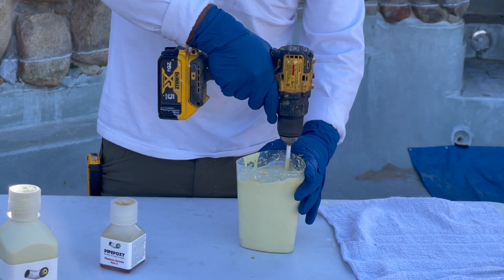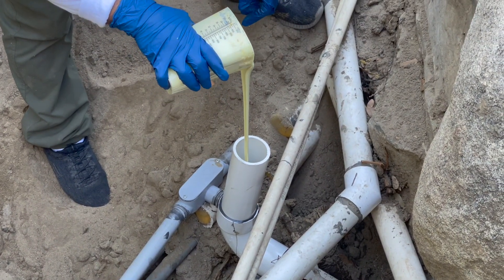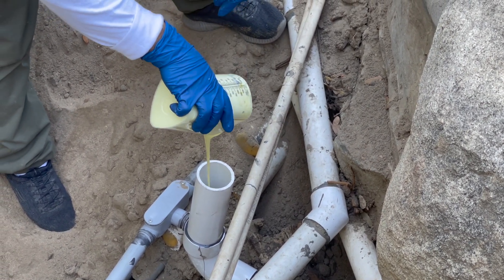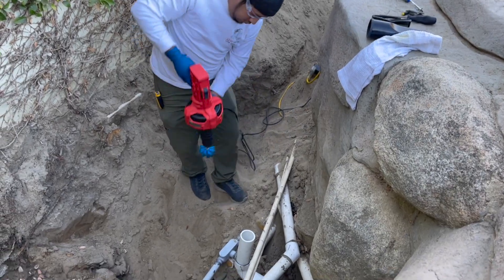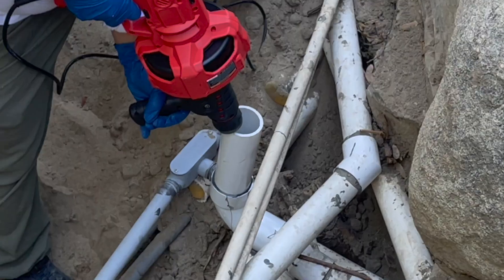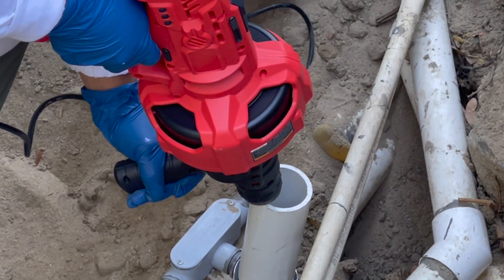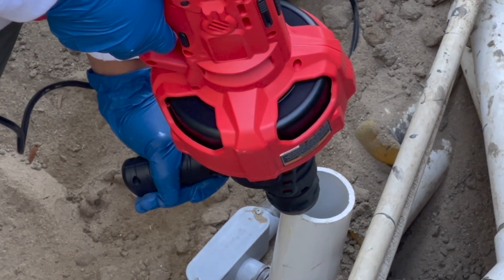It took more than one mix — it took two sets of parts one, two, and three. But we didn't have to pour the whole second part in there. We pour it in, we get it ready, and then we send our brush in. Our brush is going to push all that material forward and keep going forward until we pass the area of the actual leak. We want to coat a little before and the whole way through, maybe a foot or two after the actual leak.